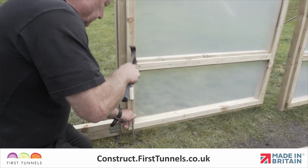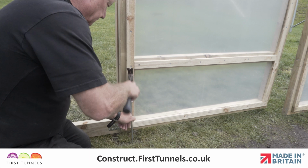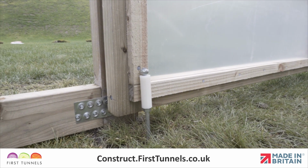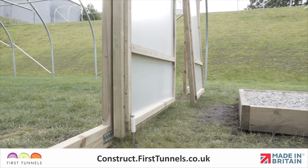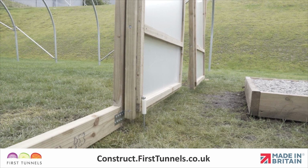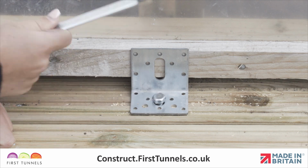Position the door guide in line with the door frame post which the door slides past. Making sure it is upright, drive the guide into the ground. You will be required to repeat this process for both doors. If you have a hard base, fix a door frame post plate to the floor.